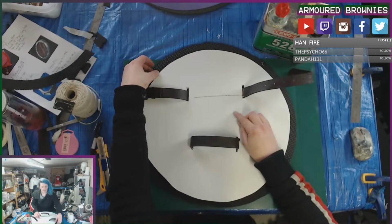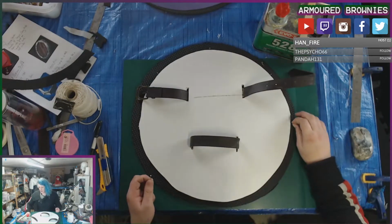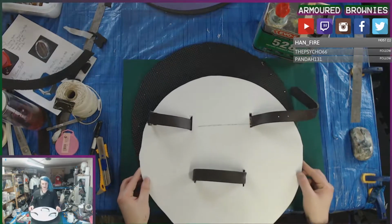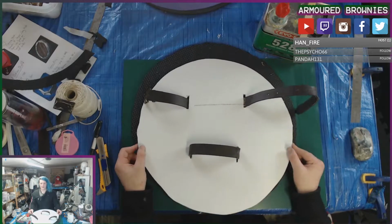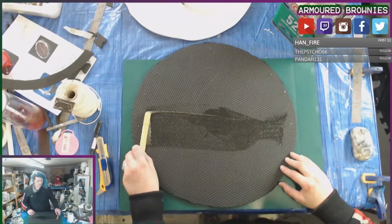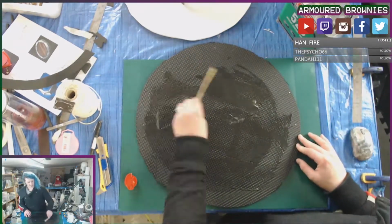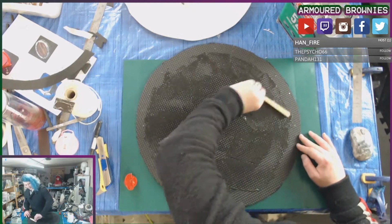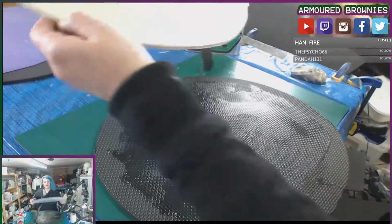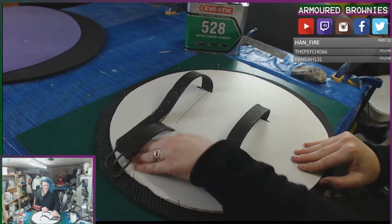Now, to seat the plastic exactly where we want it, you can see I've set a ring of pins around the edge. So we're able to use that to guide the plastic back in directly onto the glue, because of course with a surface area this large, using the contact adhesive, once you put it on, you're not going to get the opportunity to move it around or pull it apart particularly easily. So we're being very careful and double checking our work to make sure it is as centered as it can possibly be. And centered might not be the right word, we just want it to be in the same place that it was before, so it matches up with the ring that we're about to put around to fill the sandwich gap as the filling.